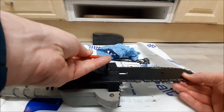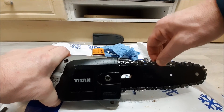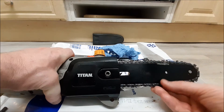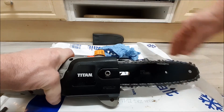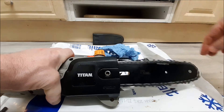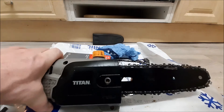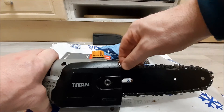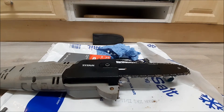It's worth doing it to get it right. Probably about right now — maybe just a fraction looser, but on the whole that's not too bad. You want to be able to pull it up a bit. You can run it with your hands and see how smoothly it moves — that's probably all right actually. It'll probably slacken a little bit after first use, so once you use it the first time it's worth checking the tension again. It's seated down on the drive cog now so you might have to fiddle a little bit.